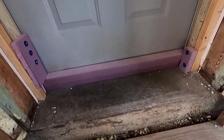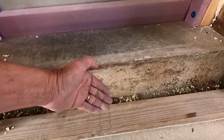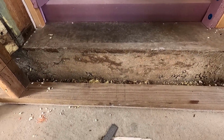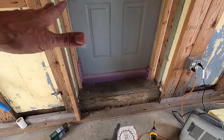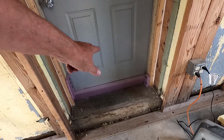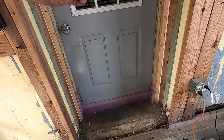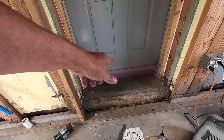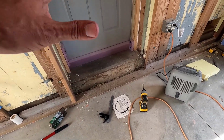I'll get into this a little bit later, but if the house ever floods, water is going to come on this concrete, go down this wall, and go under this plate and through the drain. So I have to allow for that. Again, you'll see what I mean once I get into it. I'll actually pour some water there and show you how it's going to work. We've had a major flood in the house at one time, and it was just a pain, and we ended up having a little sump pump right behind where the door is here, and we pumped it out from there because the house has settled a little bit and everything comes towards this door. So if we do get a flood, everything's going to come right to here, and we want it to be able to go over the step and into this drain, and that would all happen underneath the floor.